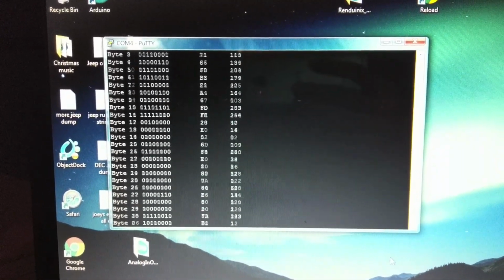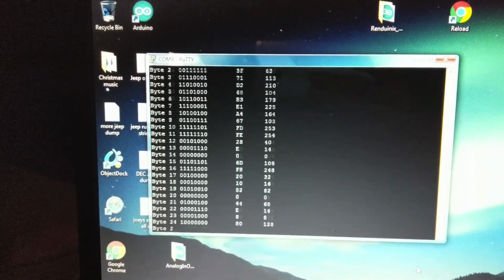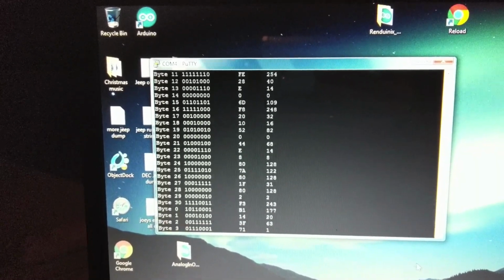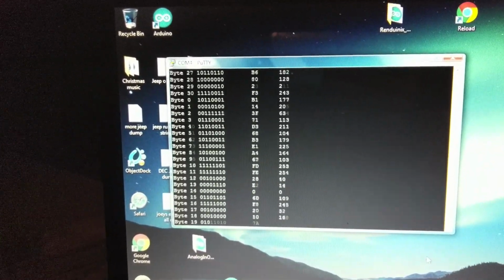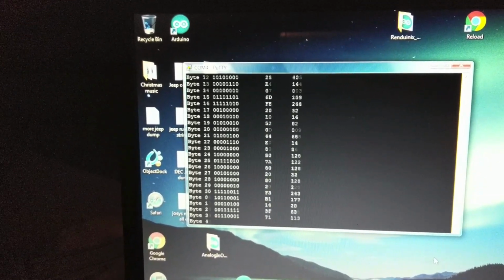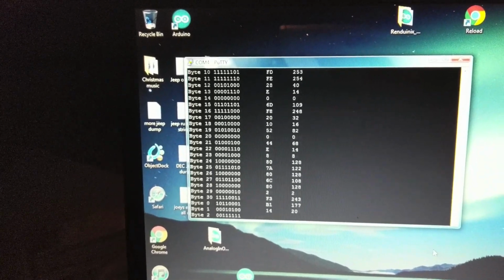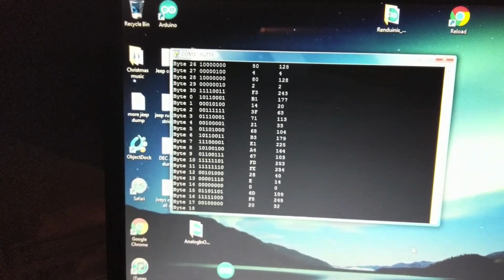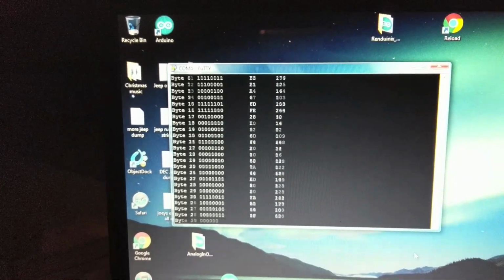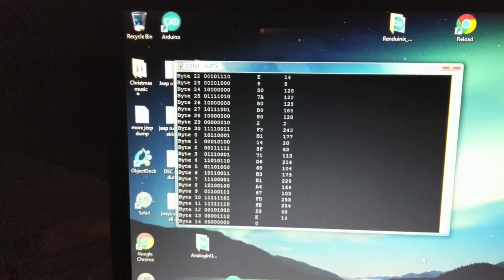What this code does is it loops, and it looks for three things: the stop byte, the start byte, and then the only other condition is that the next byte after that is not 0. He had an issue where, if the vehicle was off, that pattern would show up elsewhere, like a 0 and a 1, or a 0 and a 255, so he put that in. In my code, I have it set to look for the program number, because that's a lot more accurate and shouldn't change, so you should always be able to find the beginning. But this is what it looks like when it's coming out of the computer.